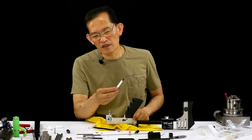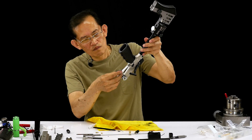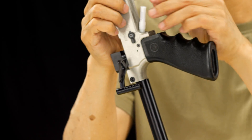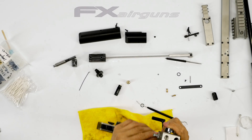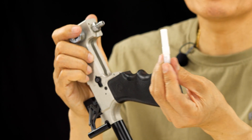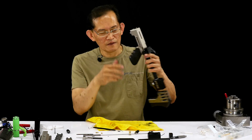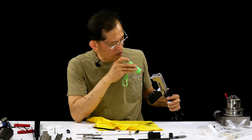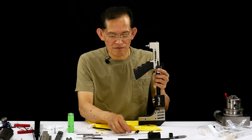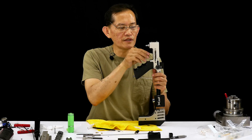Shove the piston in this position so it doesn't fall off the tool. When it's in there you can flip it back up and press in until you hit a little snap and it doesn't want to go in anymore. Pull out your tool and make sure there's no washer in it — always verify, you don't want to damage the piston or smash the washer. That's already pre-lubed, slide it in.